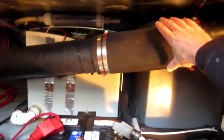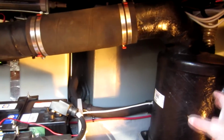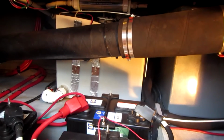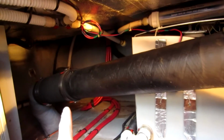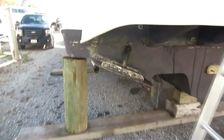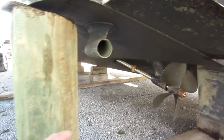As you can see, there's a coupling on either side of the solid fiberglass. Now this is the main exhaust coming off the port engine. There's the muffler, obviously, and that runs out. This boat, a Sea Ray, has what they call their patented underwater exhaust system. So the main thrust of the exhaust drops down. There's two little torpedoes underneath the boat. I call them torpedoes, they look like it, and that's where the main exhaust runs out.